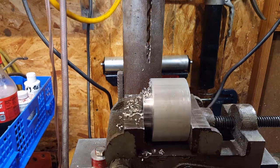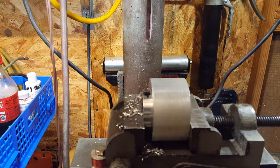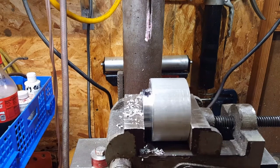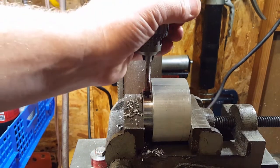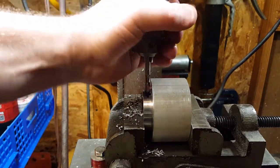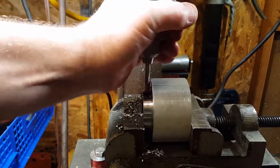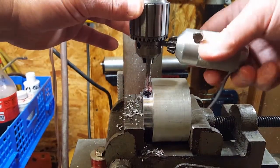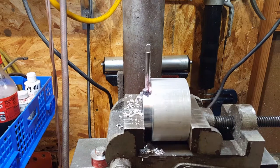You can use it both to drill and tap the hole. You might be wondering why I'm chucking this up in the drill chuck to tap the hole. Well, I'm not going to do it under power, but what I am going to do is use this — since I haven't moved anything — I've got a starter tap in here of a quarter-28, and I'm just going to start it by hand, then I'll finish it up on the bench in a vise, running this tap through it. Then I'll run a bottom tap to make sure I've cleared the threads — everything will be all good.